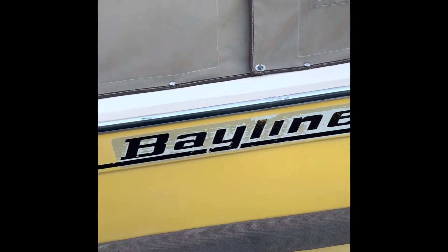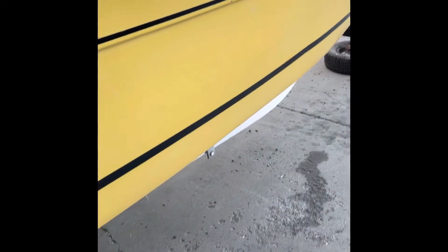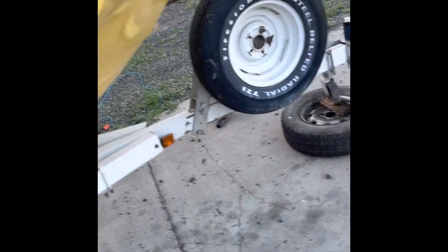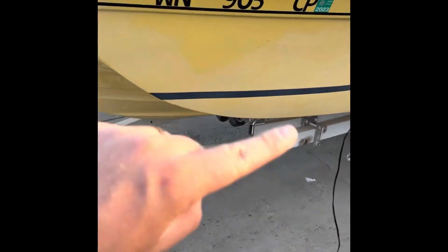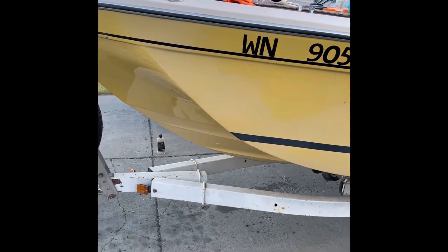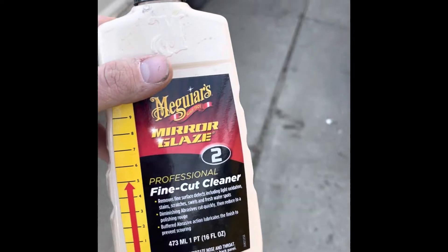I'm going to keep going on the buffing on the other side. You can see I did where the registration numbers were. I'm going to try to knock this out tonight — at least from the rub rail down, and that didn't take long at all for a decent-sized area. I picked up Meguiar's 67 One Step Marine RV — that's what did that area. The other side of the boat was Meguiar's Mirror Glaze Fine Cut Cleaner Number 2. I ended up running out — we're getting really low. That stuff worked really well. I've gone through a whole bottle, not just on the boat — I've buffed a lot of fire trucks with that stuff.